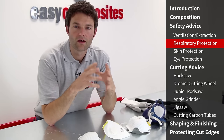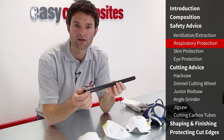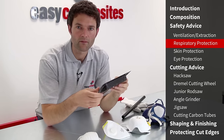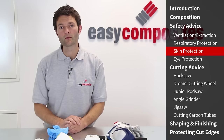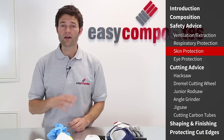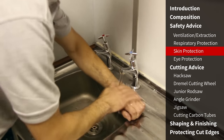The next safety consideration is your skin. There are two risks when trimming carbon fibre: cuts from sharp edges, and irritation from fine dust. Ready-made parts like a seat post are unlikely to have dangerous edges, but freshly demoulded carbon fibre parts can have razor-sharp edges. Skin irritation from fine dust is very common, most likely affecting your hands — particularly between your fingers — and forearms. Thin surgical gloves can keep dust off your skin, but for heavier trimming we'd always opt for a disposable full suit as well. If you get carbon fibre dust on your skin, wash it off with cold water, not warm or hot, to avoid opening your pores.